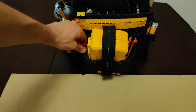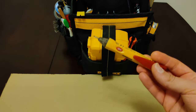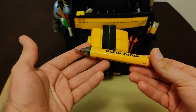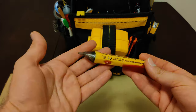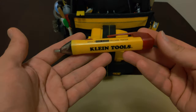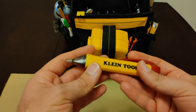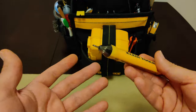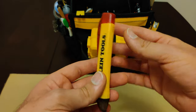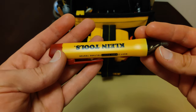On this side here we got a voltage detector pen. This is a very good tool to have when working with electrical things around the house. You hold it close to anything you want to check for the presence of voltage. I use this as an extra measure to test things before touching them, just in case I've forgotten to shut off the breaker or shut off the wrong breaker for an outlet or switch that I'm working on.